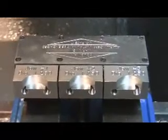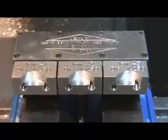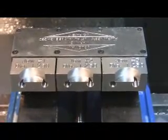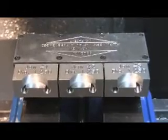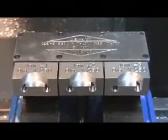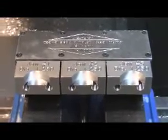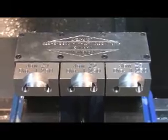Here's the fixture that I made for holding my swashplate leveling tools, the ones that are an inch and a quarter in diameter. I machined three jaws there to hold my slugs while they're being machined. I'm using a SolidMax vise jaw to hold these and it equalizes each one of the three to make sure that none of them come loose during the machining operation.